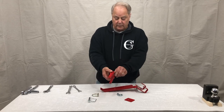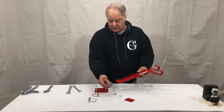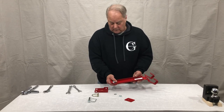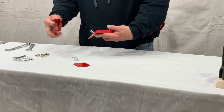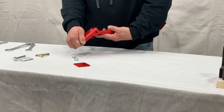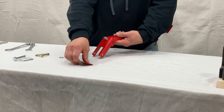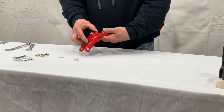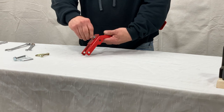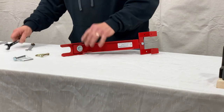Take your ball-mounting base and your 7/16ths-inch bolt with a washer. The ball-mounting base flanges will go up, and you'll tuck your lift arm right in between. You'll take your support stiffener washer, three-eighths lock washer, your 7/16ths lock washer and your 7/16ths bolt. Now take and tighten that up.